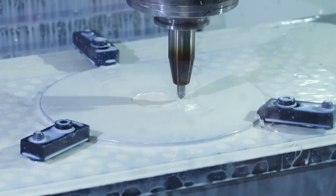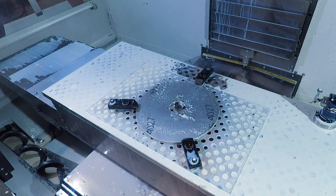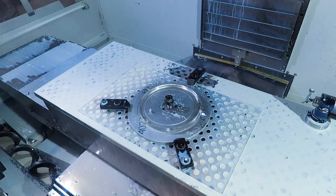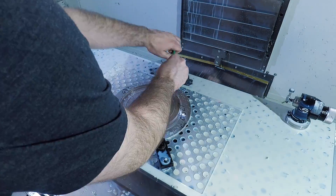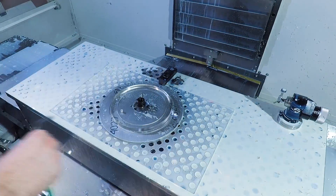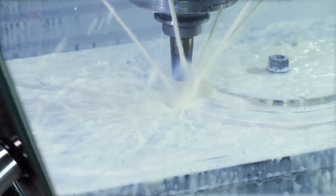The one thing I did differently when cleaning up the perimeter this time was use these acrylic clamping cauls cut out on our Boss Laser — card here for our video on that. The thinner ring of acrylic ensures that clamping pressure will be applied where we want it, near the outside edge of the part. The stack of washers you see in the middle is there so I can repeatedly snug down the bolt without risk of cracking the acrylic.